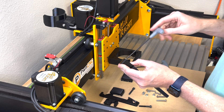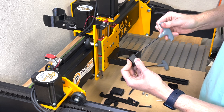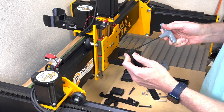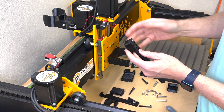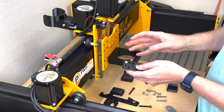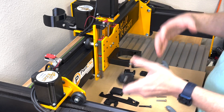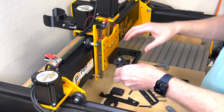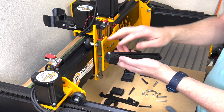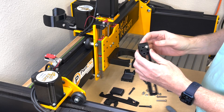Don't use an electric driver — you will likely strip something or damage parts. These are plastic and we want to treat them with care. They are designed to break: if you run your bracketing into some clamps, we want that plastic to break, not your boot, your aluminum tracks, or your machine. That's why they're made of plastic — they're made to absorb the impact.